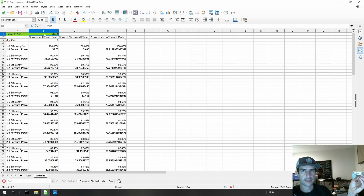Now we can look at this first column here with values like 1.0, 1.1, and so on — that's what we call our SWR reading. SWR stands for Standing Wave Ratio. An SWR of 1 means all of the power delivered out the end of the coax is going into the antenna and being radiated into the air. An SWR higher than 1 means some of that power is getting reflected back to the radio — the antenna doesn't like it, it's not a good match, usually the wrong length.